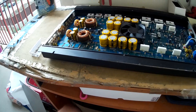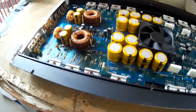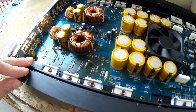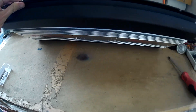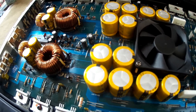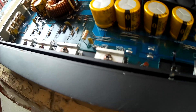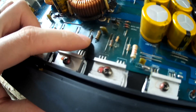Let's take a closer look inside. Wow — there are good copper coils here and a big heatsink on the back. All you see here is aluminum heatsink, and there's even a fan. The problem was it powers up but there's no sound, no output. And I can see here there is a resistor that is burned out.